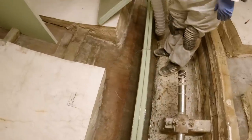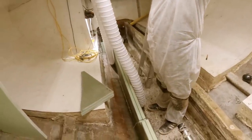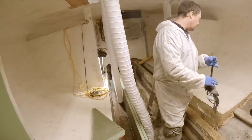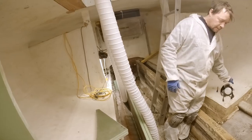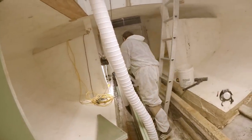It's just the matting over the top, and we'll slap a coat of resin over the top of it to make sure it's sealed, so water can't get in there, find a crack, and freeze and expand, because there's a good chance that this will go back into service as a freezer boat at some time. So we want to make sure that we're protecting everything that we can.